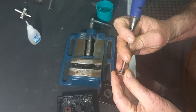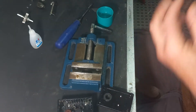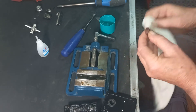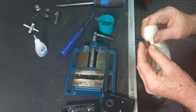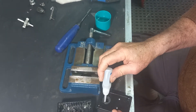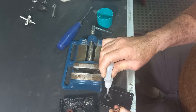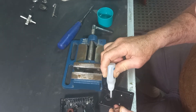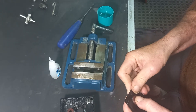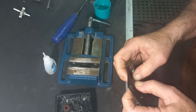Don't lose the outer ring — very, very important, don't disturb it at all. You take this bush, same story, give it a clean all around. It's actually quite clean. Give it a wipe, remove whatever excess you see there from old glue or anything else. Now in this instance you put the glue — same story, you can put it there — and press that all the way home, making sure it absolutely bites. It must basically be flush with the outside, that's how hard you've got to press it.